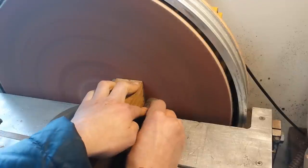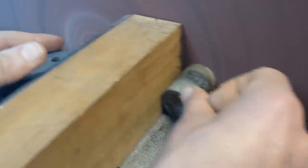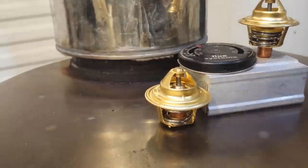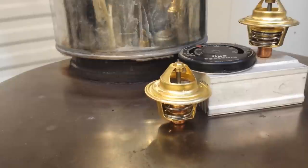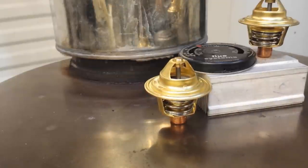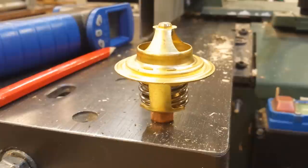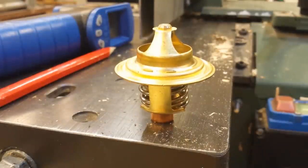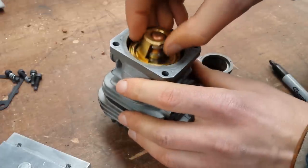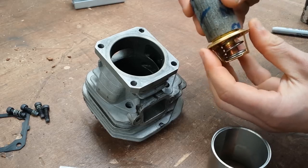So we want a little scrap of pipe like this to support the wax thermostat inside the cylinder bore, and it wants to be as square as possible, so careful hacksawing is recommended — in my case I needed to square them up a bit on the disc sander. What's this pipe actually supporting, I hear you ask? Well it's this automotive-style wax thermostat, which is kind of the prime mover of this whole operation. It's what's going to push that sliding pin which will eventually lift the whole thing away from the surface of the stove. These things are simple, robust, and reliable so they should serve this purpose quite well. I'll leave a link to the one I'm using in the description.